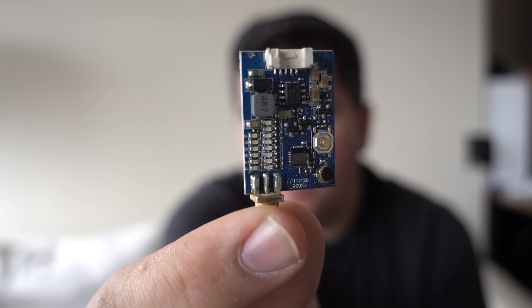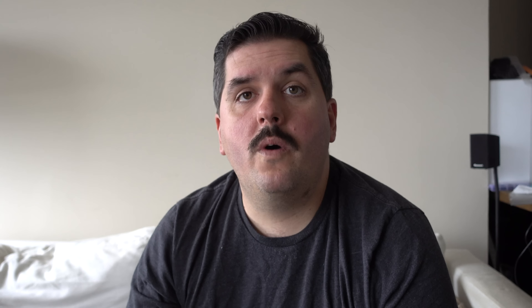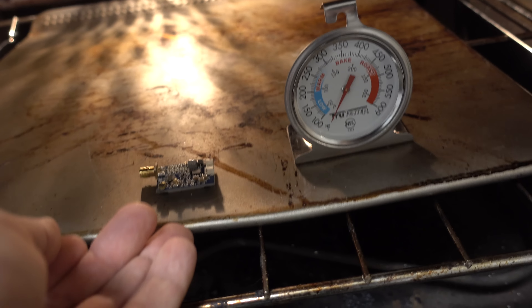I did a little bit of extra googling because I really want to make sure that I do this right — I've never tried to reflow a circuit board. I've got the VTX completely stripped of all the components. We're going to set this up on a baking sheet and crank the temperature of the oven to 450 degrees Fahrenheit. I'm going to put a thermometer in there and set a timer — about 20 minutes it should be up to temperature. While it's at temperature, you don't want to move anything around. We're going to wait until the oven hits 450, then turn it off and just leave it to sit there. If you jostle it, you can end up moving some of those tiny components on the circuit board, and that's going to be counterproductive — you're going to break things. So we're just going to heat it up, let it cool down on its own, and hopefully this VTX will work again.